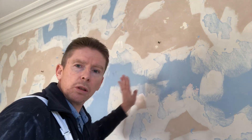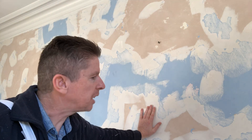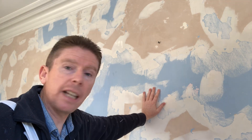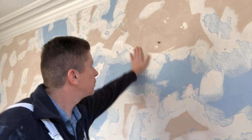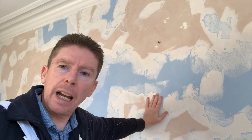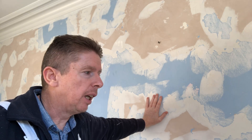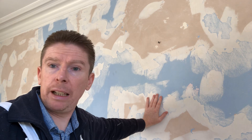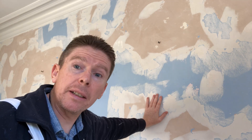As you can see, this wall's all been filled, sanded and ready. The only thing I need to do is size it — you can see it's really, really dry. There's a lot of filler on it. If you're ever hanging wallpaper or laying paper and the wall's really dry, you can get a sealer — a Zinsser, that's a good one. I just use a thin paste, it's all that's needed to be honest. Let it dry and then put your laying paper on.